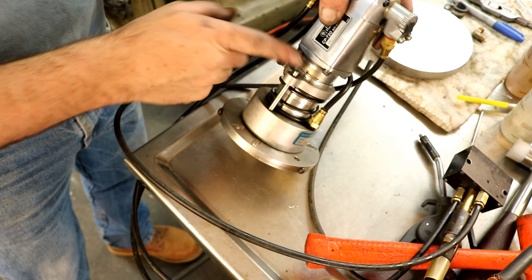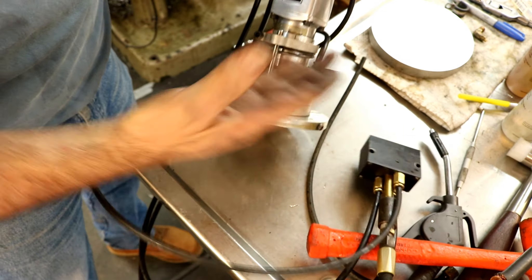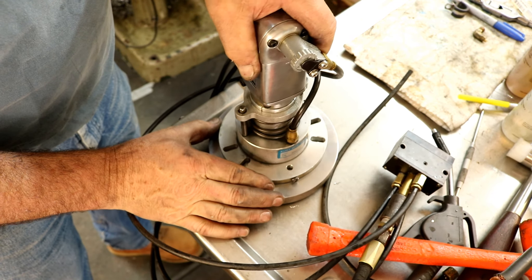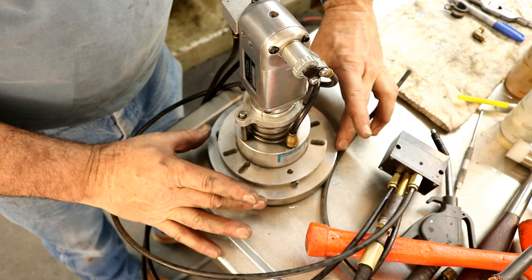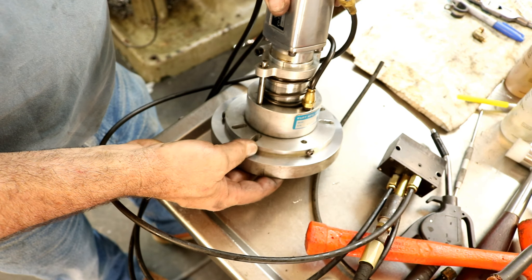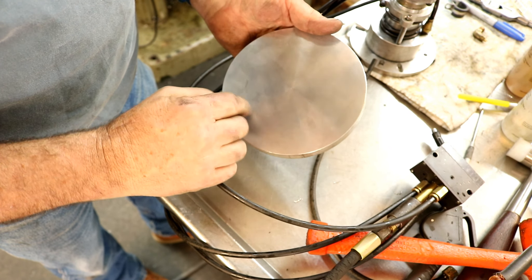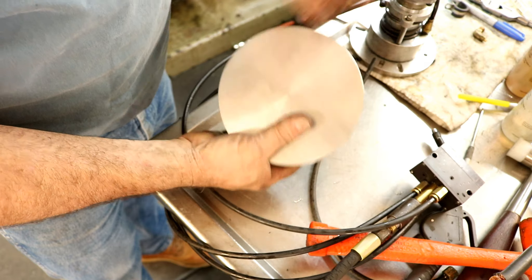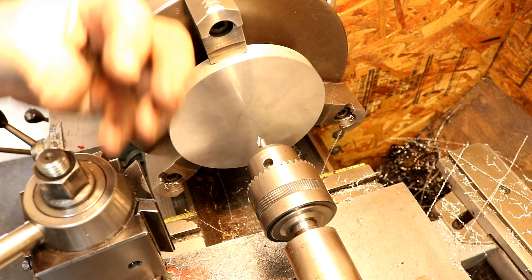Here are the new power draw bar parts. I showed how that goes up and down — I had it all rigged up and tested, things work just fine. This is going to mount on top, but it's not big enough to reach out to where the holes need to be, that's why we're using an adapter plate. We're going to get a mark and get an idea of how big a hole pattern we need and where the holes need to go. I decided to put a one-inch hole in the center, and I'm going to use that to align with the top of the mill.